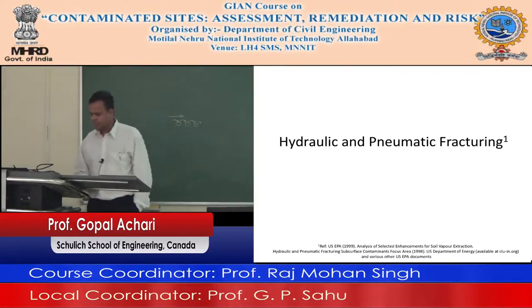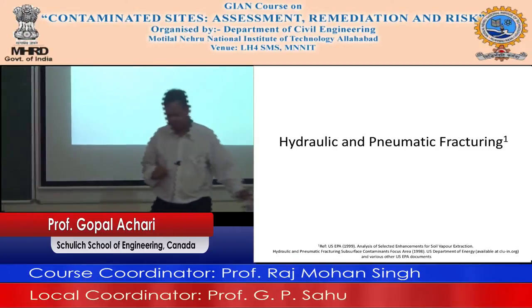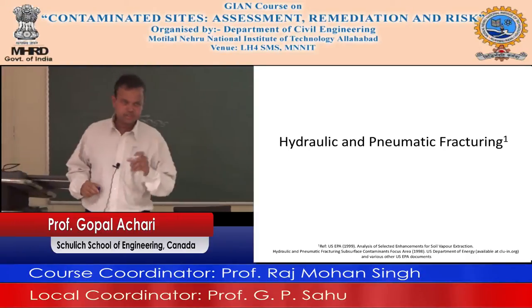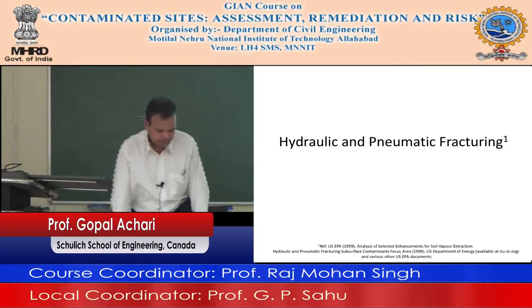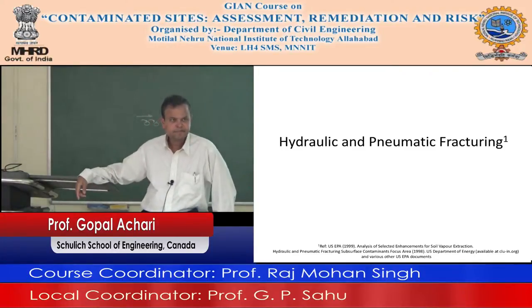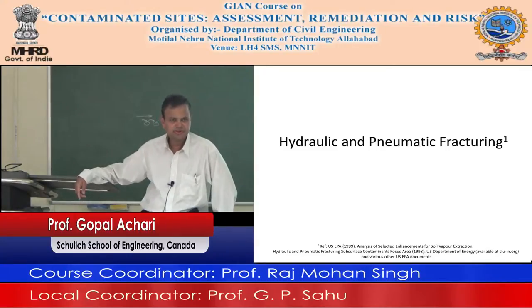Okay, so look at the technologies that we have talked about so far. We have talked about soil vapor extraction, we talked about soil flushing, washing, we'll talk about others as well, right? What is common amongst at least the ones that we saw in terms of the soil type that can be treated? Highly permeable or sandy material, right? See, most technologies will work with sandy material, okay? The problem is when you have clay. Every single one of them, you'll run into trouble once you have clay, okay?